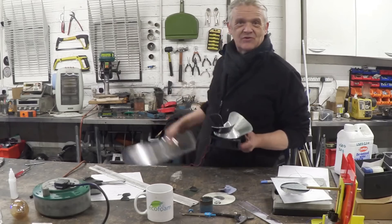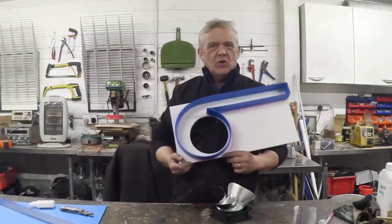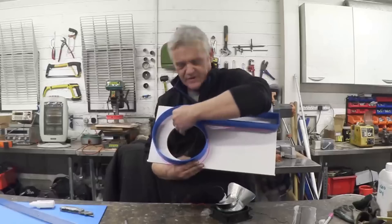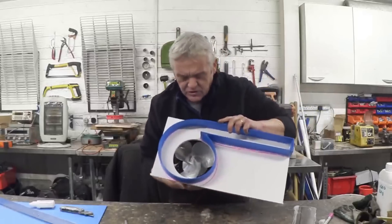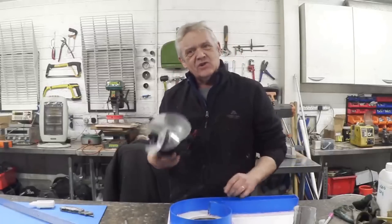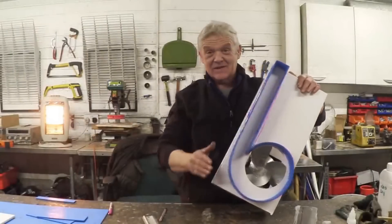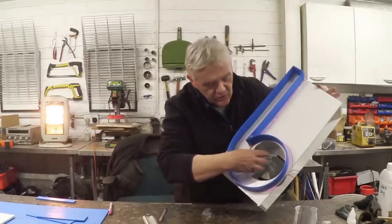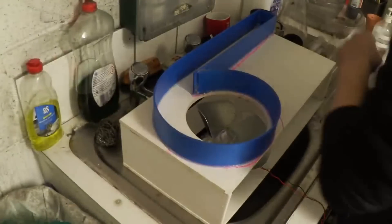The next step is obviously to get the vortex on it. I remade the involute out of a bit of filter board and a strip of plastic — the same thing is going to happen: water comes down this channel, goes round the involute, creates the spin, and then the Rose gets fitted under there. The spin of the water should hit those fan blades and make it generate. So let's attach the Rose under there. It was really easy to make — a bit of builder's board then a strip of plastic bent around into this involute leading to the opening where the Rose is. I'm going to pour a bit of water in here and we'll see if the Rose will spin.